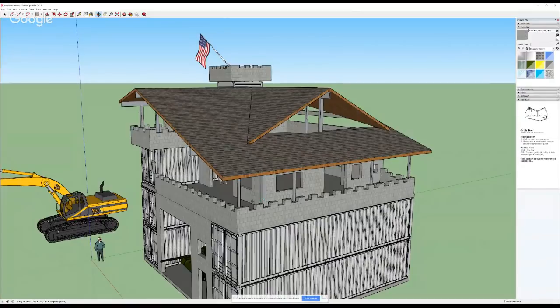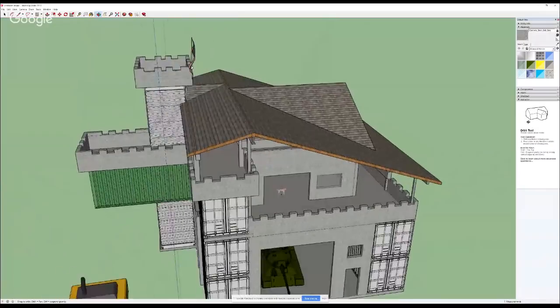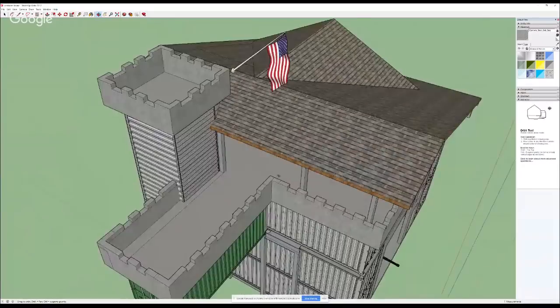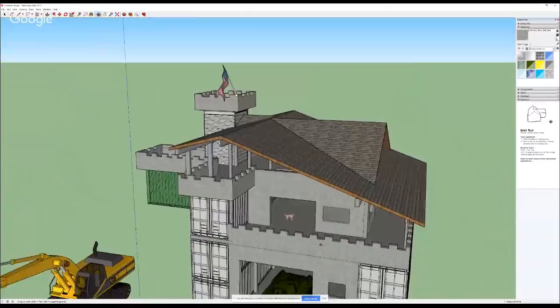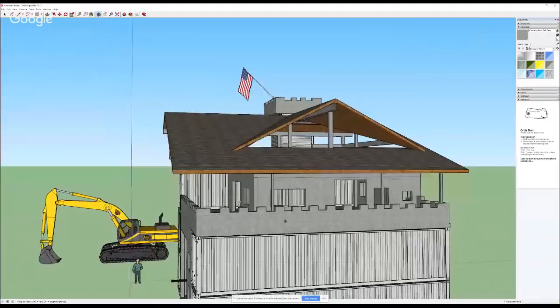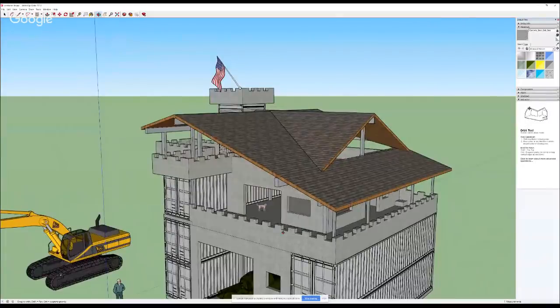Yeah, John, I do like your idea of the skid steer mixer. That is on a list of stuff I want. If the right thing comes up, I may get one. For all the concrete pours I'm going to do here, I'll try to keep them bigger pours. For example, this is going to be a decent pour on top of the bridge. Every block on this project is cored, meaning they're filled solid with concrete and they've all been done by hand. Well, not by hand. I have that barrel mixer thing, but you still have to load it by hand and it's hard. If I have a concrete mixer on the skid steer, I have that concrete bucket too, which would be cool because I can pick it up with my crane.